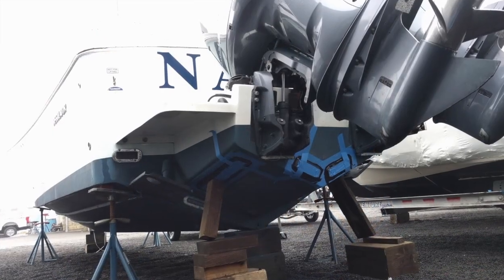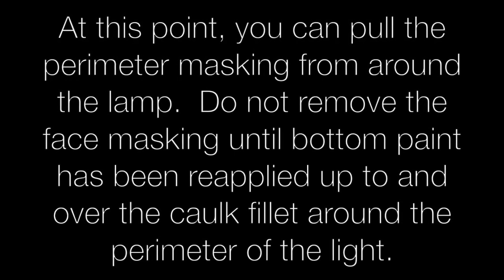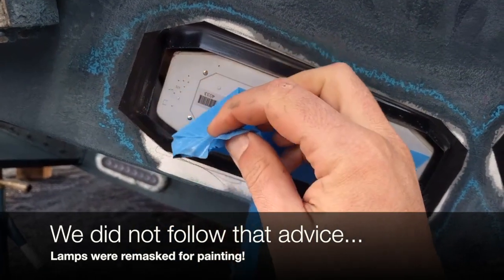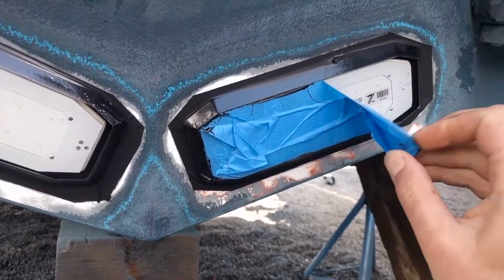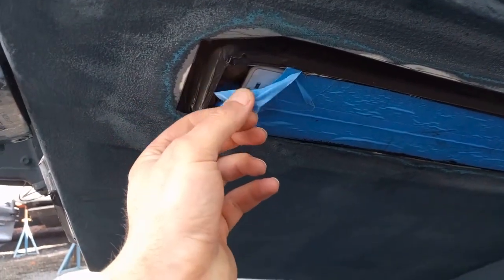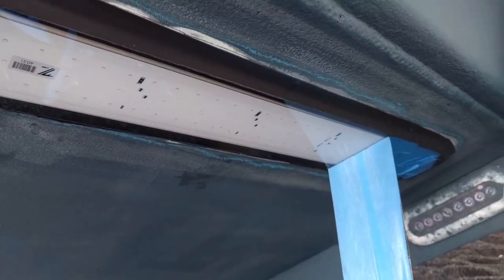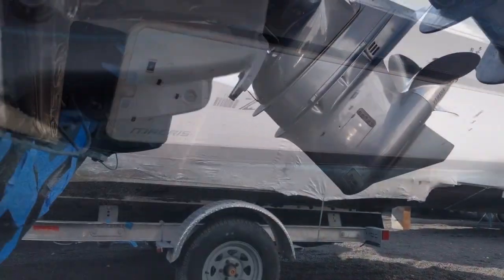This shows you all the lights as installed, finished, in place, and cured. When the lights are mounted, pull the perimeter masking — typically right away. Wait to pull the face masking until you've painted the boat. These kicked overnight and the next morning we went back to pull the face mask. The border of the light has a nice black border around it with no air bubbles or gaps. It's a complete lamination — these lights are basically part of the boat now and they'll last for years.